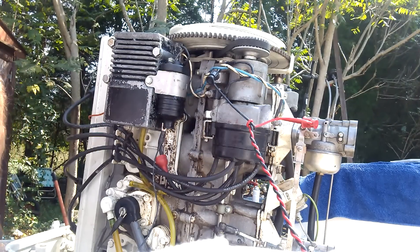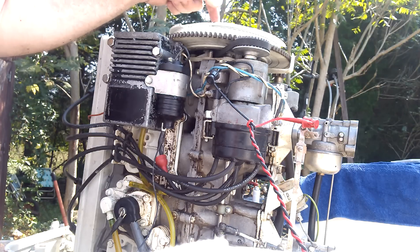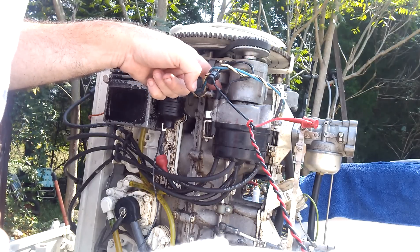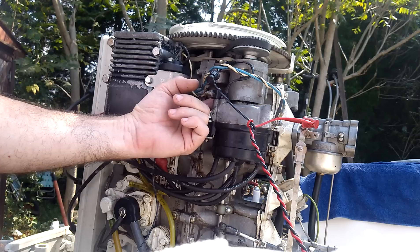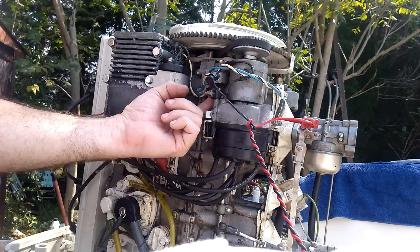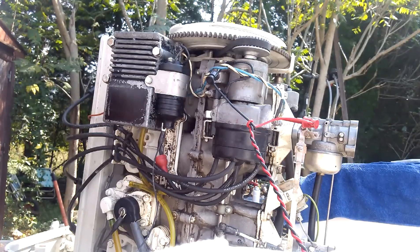So now we're timed. Back to the point about having a key that's broken in the flywheel — the flywheel may have slipped relative to the crankshaft. I look right here and I see I have about 5/8 of an inch between the block on the distributor that moves and the block on the other end of the link on the tower shaft. If you've got what the factory specs, your key's probably okay. So everything looks good on this one.